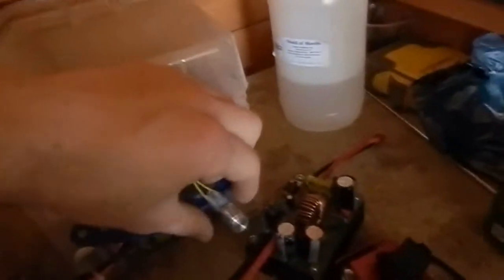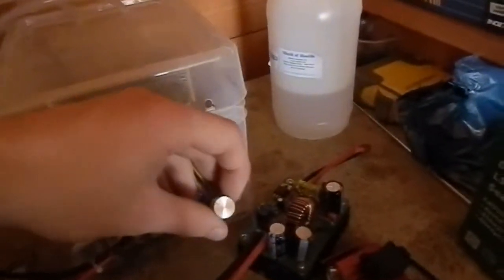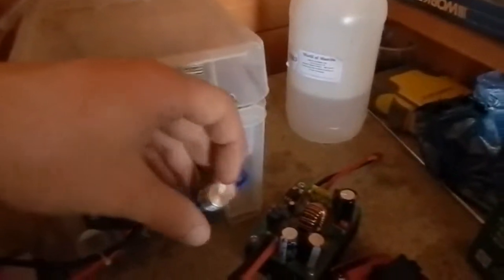Also, another modification I did, if you look at these inverters, this is made by KD. It did have a very small surface mount potentiometer next to where the LED panel is. The connector comes off there, so I just extended it. What that does is it lets you adjust the power of the inverter, or rather its maximum power voltage, for working with different solar panels.